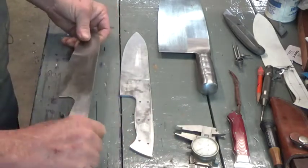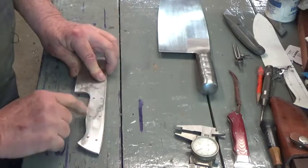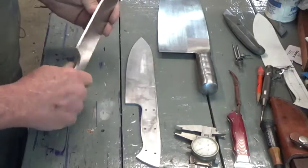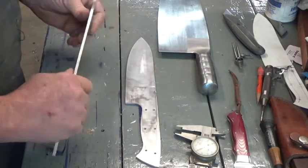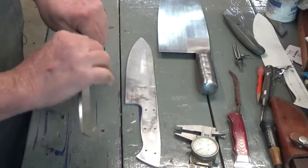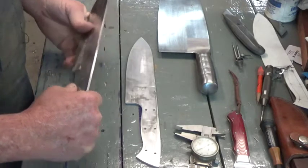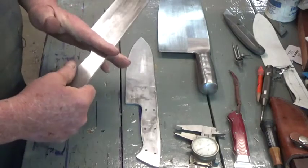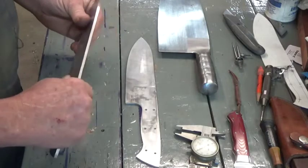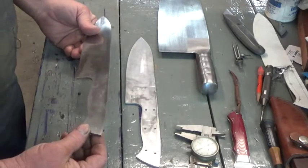I'm going to clamp this back using this as a drill guide, get my holes drilled, and then put layout blue around the perimeter and strike my lines. On this knife, although this is eighth-inch stock, it's 25 thousandths over, which is fine. All I want to do is get a flat established that I can work off of. The actual thickness of the blade stock I don't take that much into consideration in this style of build. If I were doing one with a slotted guard, I'd have to get more precise, but this knife will have no guard.